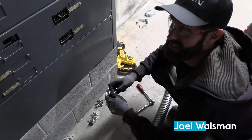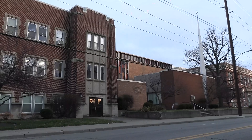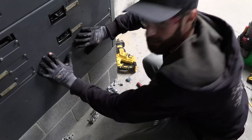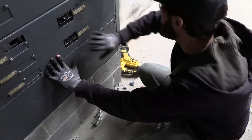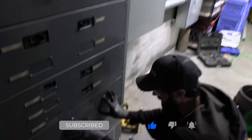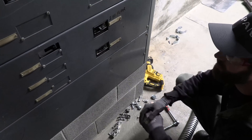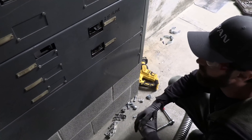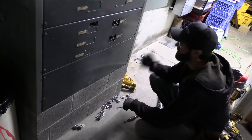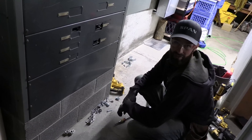We're going to shut off this 1965 main disconnect. It's Saturday afternoon and we've got to kill power to the entire building. We're going to use the 10-foot tap rule from Article 240, run a set of conductors — 250 kcmil — up into that 200 amp disconnect. We couldn't acquire a breaker standoff kit for this old piece of equipment, so we're going to use the 10-foot tap rule, put 200 amps on this bus, and take care of a remodel upstairs with a new 200 amp three-phase sub panel.